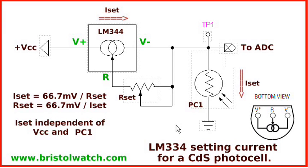Here's the setup for the LM334 using a photoresistive cell instead of a thermistor. Everything works the same way. You would need a spec sheet, or you can measure it yourself if you can control the light intensity to get an idea of what you want. You can set a target resistance to produce a target voltage on TP1 to go to your analog-to-digital converter on your Arduino. The LM334 constant current source gives you stability, and you can adjust RSET to get the target range you want.